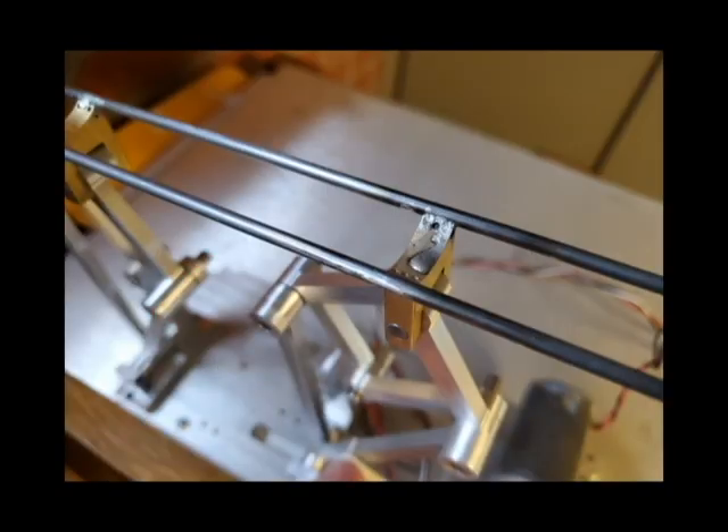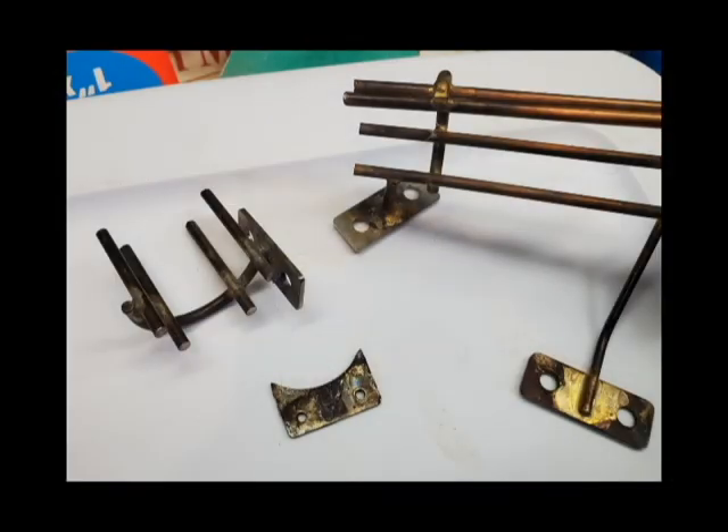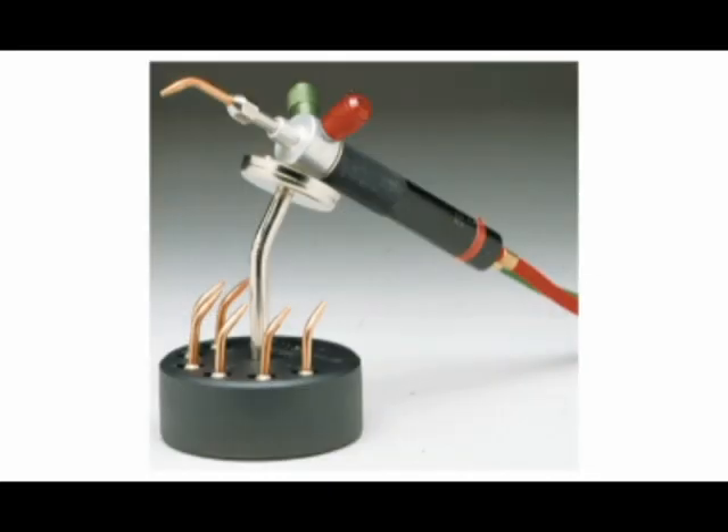The ramp is a little bit crude for now, but the idea is to silver solder it all together with rails on the brass blocks or sheet metal blocks. I've got some laser-cut thin sheet metal — they soldered up pretty good with silver solder. But my mini torch needed new tubing; it wasn't working when I made this. The original stuff was latex rubber and over the years it turned into something that looks like cheese.